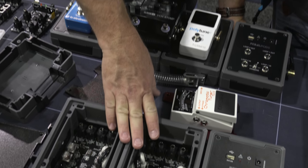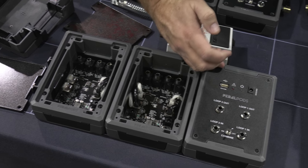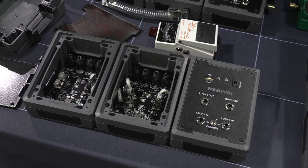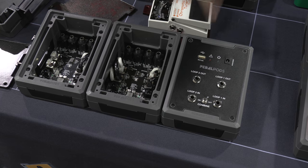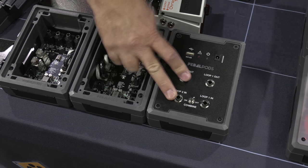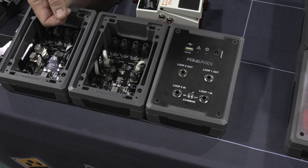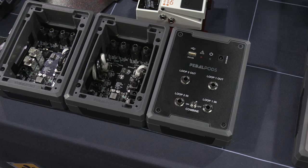What makes the system unique with our wiring topology is this — we call this the gas pedal. The upper half of this gas pedal is a voltage regulator and monitoring system that takes your power coming in, looks at it, and actively dumps the noise that's coming in on the AC line. You have an isolated 5-volt charger for your handheld devices or if you want to do a downlight. The lower half of this provides two loops of audio with two audio file buffers that you can physically switch in or out of the circuit.